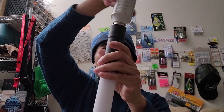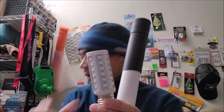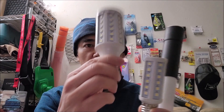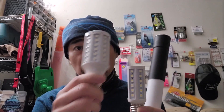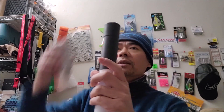The great thing about this light pole is you can switch out the bulb. I think this one is about 10 watts, and this other one is about 8 watts — don't quote me on that. Different sizes can be brighter, so it's interchangeable. If you want a brighter light, use a bigger bulb. Again, make sure all parts are DC components — do not buy AC components. And remember, a bigger light will obviously drain the battery faster.